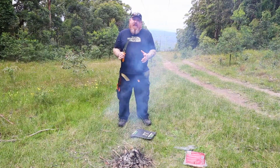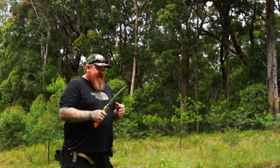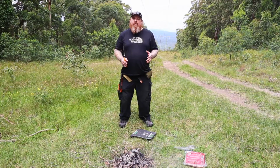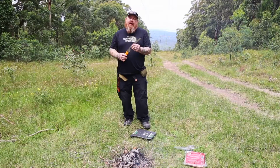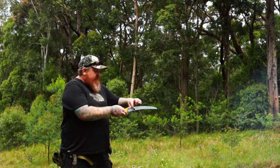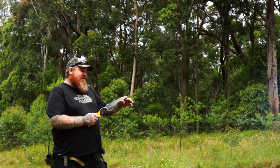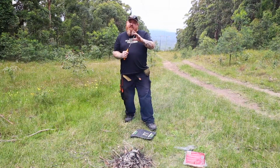Now, every Silky, as far as I know, only cuts on the pull cut. What that does is it saves you breaking blades. You will still break blades, anything that's sawing through hardwood, or knives, everything has the ability to break. What the pull cut does is reduce that. Your force is pulling towards you, and you seem to keep that blade a lot straighter on the pull cut than when you're pushing. On the push you've got no brace, so you've got a bendy blade, which they're meant to bend. That also saves breaking. Really stiff blades will break a lot easier.